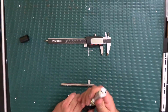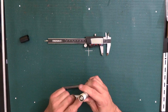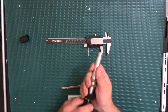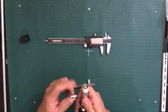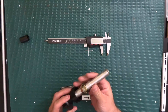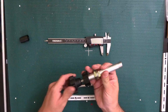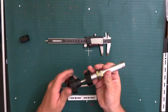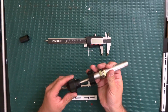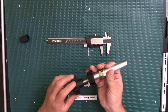Normally a cable would be attached right here, and when you pull and push on it, that cable pulls and pushes on the throttle body somewhere near the engine. Of course, you can also twist it to increase the RPM. It takes forever, but it's good for making little adjustments. And you can go clockwise to decrease the RPM.